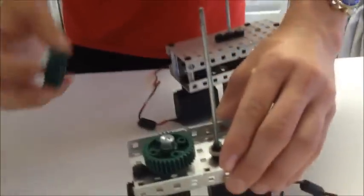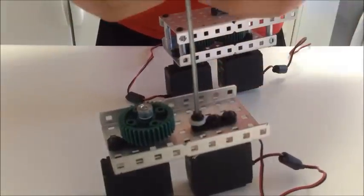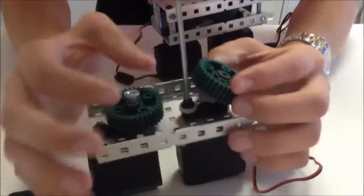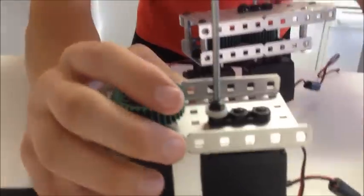The first stage is the motor box. This is the box that specifically pairs the motor outputs together. There is a 36 tooth gear on this shaft that pairs the two motors together and feeds onto this shaft, which then moves into Stage 2.